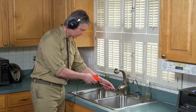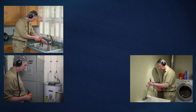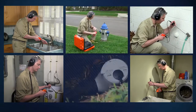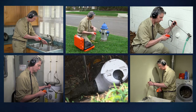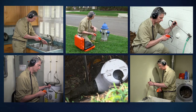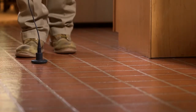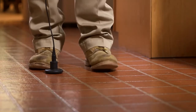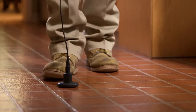To conduct a water leak survey, make direct contact with the probe rod or the magnet base to all sink lines, hot water heater lines, hose bibs, hydrants, and main valves. The spots with the loudest leak sounds will give you a general location of the leak. When you hear the sound of the leak, check water lines running in all directions from that point. The leak location is usually found between the loudest and second loudest survey locations.